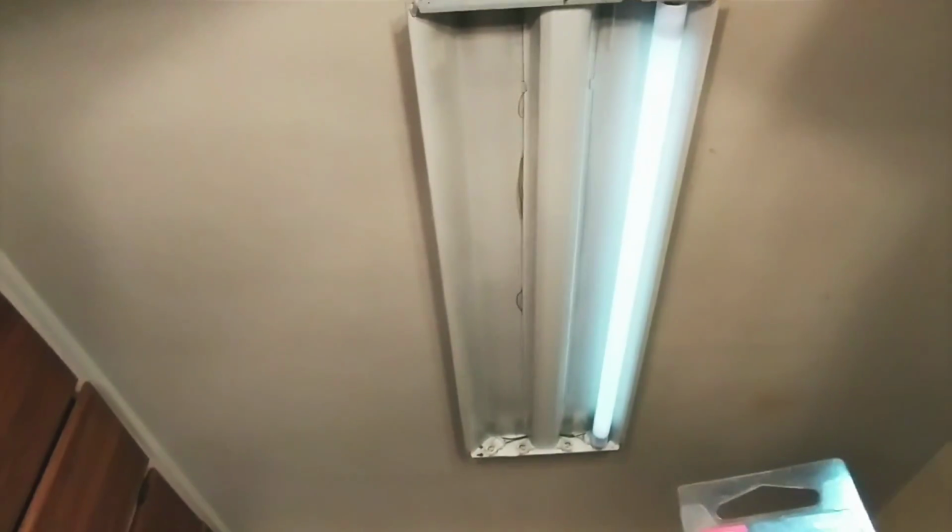Hey everybody, today we are going to be learning how to replace a pull cord light switch, apparently. Lucky for you, there's not a ton of supplies for this project. You'll need a pair of wire strippers, butt splice, and a new switch. You can tell which switch it is because it's kind of a universal one. It looks like a little snail shell. This works for fans and lights like this.